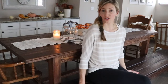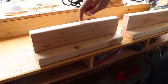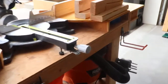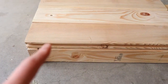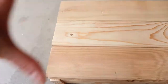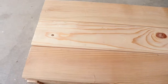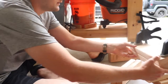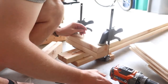I like it because it's nice and sturdy — not a cheap seat that rocks back and forth. I could stand up on it. We're going to do three pocket holes each with a bead of wood glue in between for security, and use clamps to hold it while it dries. We're doing three boards across the seat — you could do two, but we chose three because it's more sturdy. We calculated it has to hold around a thousand pounds, assuming five people at 200 pounds each, so we want to make sure there's plenty of support.